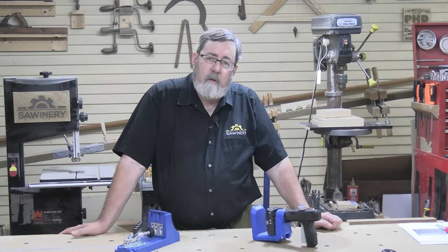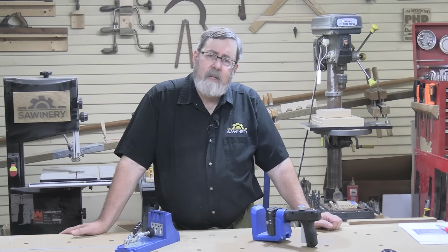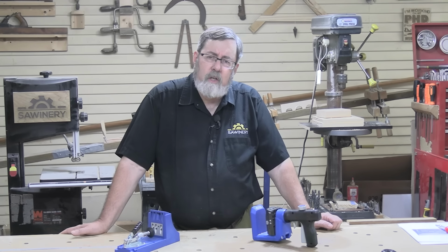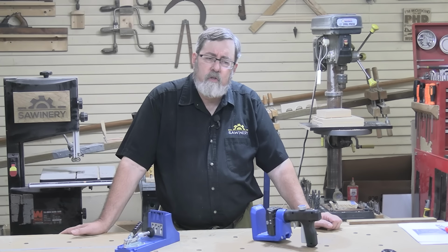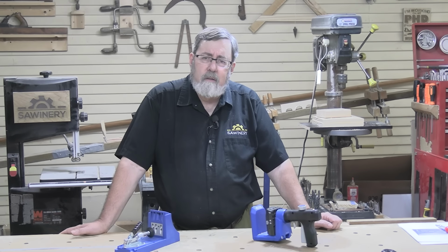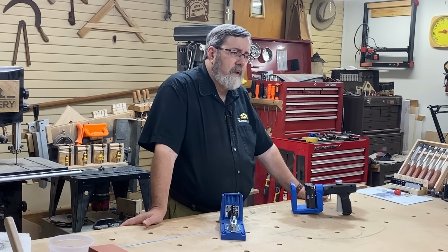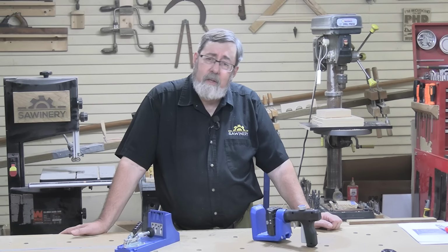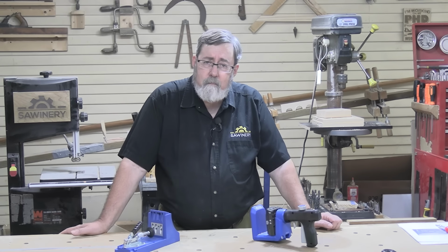And then they put something on one of the woodworking groups on Facebook, saying, I'm about to make a table for my kitchen, and I'm going to put together pocket hole joints. How many 100 screws do you think I'm going to need? Well, one, I haven't seen your plan, and two, I don't know why in the world you're using pocket holes to put that together. Just glue it together. Glue and clamps, that's how you put a tabletop together, not pocket holes. Yet there are people that think that that's the way to do it. Why? They got their hands on a pocket hole jig and they think it's great.